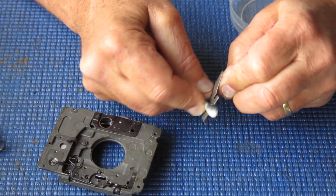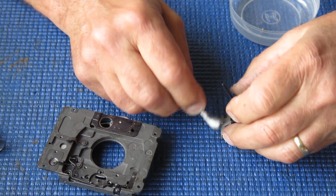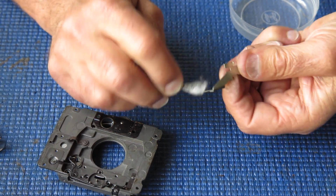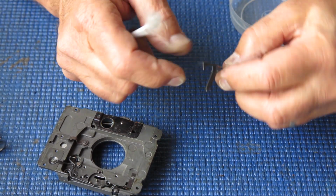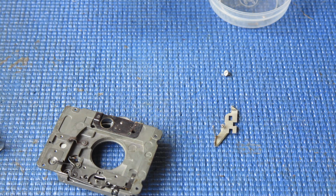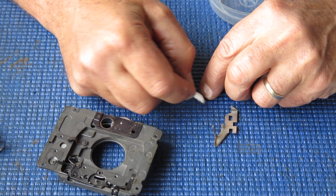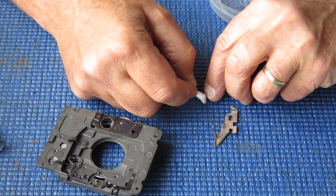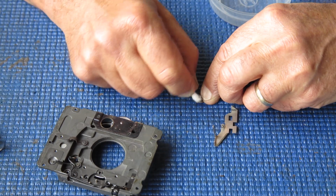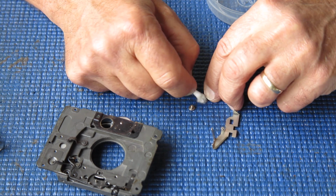That's very, very greasy. That's probably graphite grease, that one. They've been a bit free with it. We don't need it. The problem with putting too much grease on stuff is that grease is great for attracting and holding grit and dust, which might be useful, and sometimes it helps keep it away from other things, but it just becomes a grinding paste with dust and grit trapped in it. So those screws are quite dirty.